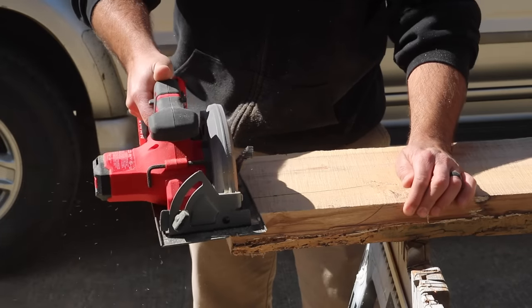The area I'm mounting this is on top of a fence, and I need to remove the tops of these fence panels to mount the patio bar top. I need to make a couple of supports — corbels, if you will — to go under the bar top for extra support and a decorative feel. I came up with a shape, cut it out on the bandsaw, and used a Forstner bit to make recessed holes for the screws, then pre-drilled with a countersink bit. Since this is basically end grain, I didn't want to split anything.